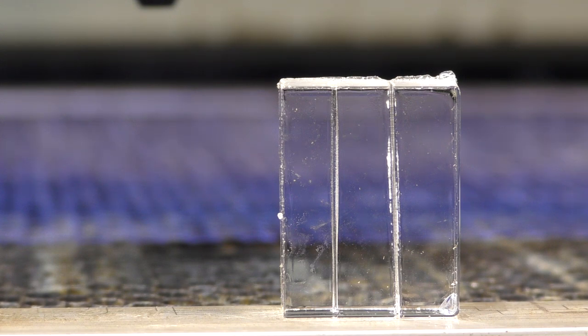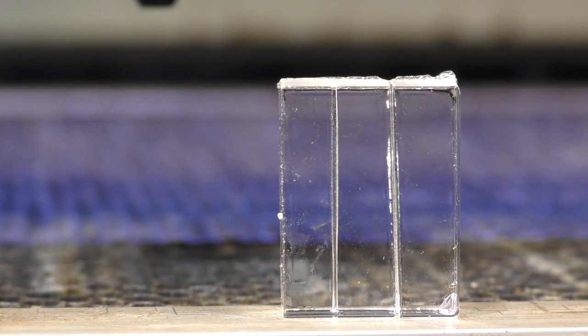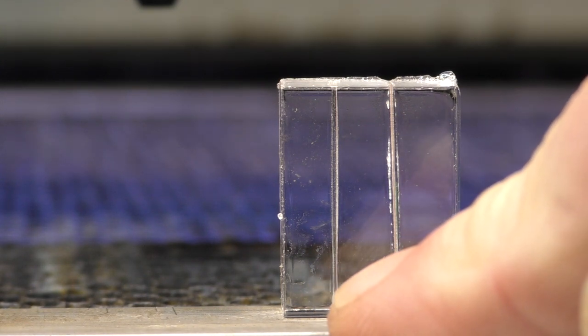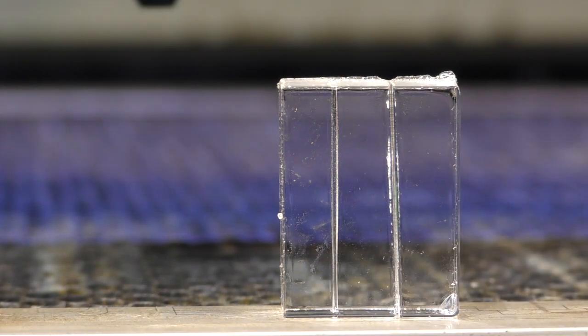That's not possible. Look, the beam should expand and disappear. To destroy that material down at the bottom there, I must be eroding, vibrating molecules, and I'm vibrating molecules a long way down from the focal point, 25 millimeters in fact. And yet the beam has not expanded. If it did, it wouldn't produce that shaped hole. And this is one of the biggest conceptual problems that you've got to wrestle with.